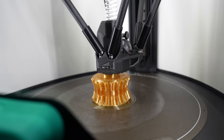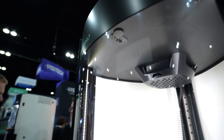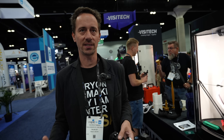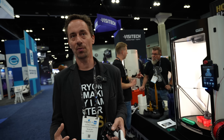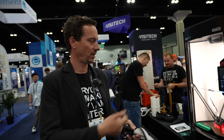About the Delta design — one of the advantages is it takes most of the electronics out of the print chamber. The belts go into the top portion, which is kept at a separate temperature than the build platform. That's a huge advantage of the Delta design: you can enclose it quite easily and take all sensitive electronics, motors, power supply, and control boards out of the heat. The only things actually in the chamber are the linear rails, the carbon fiber rod arms, and the printhead. Everything else is outside, ventilated, and kept cool for maximum lifespan.